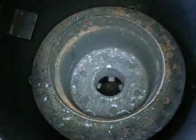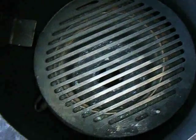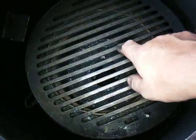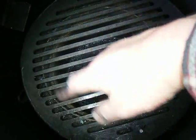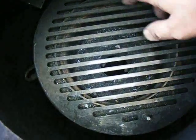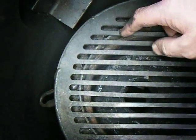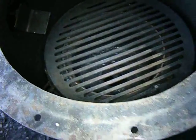This is the charcoal pit. We're looking at the underside of the gasifier — this is the floor of it. The grate occupies this space here. The grate hangs a little lower than shown, on these little chain links, which puts a fairly big gap between the grate area and the chamber that holds the charcoal. What I've been finding is that the charcoal collects in the cavity as expected, but then runs through the gap between the grate and the cavity, and out around the edges to fill up the floor of the gasifier.